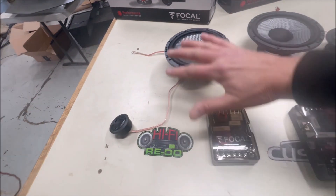So the mid - what we're going to call the mid-range woofers - are the same. The tweeters are identical; I had to mark one so I could tell them apart - this is from the two-way, this is from the three-way. They are absolutely 100% identical. The difference is we've added this three-inch mid-range. These are mid-woofers; this is a mid-range. It's constructed really just the same as the others - same cone material, same cap, same surround, same plastic basket, although it is a slightly different color.